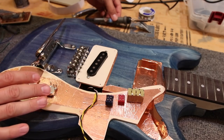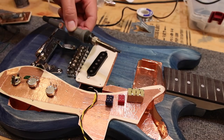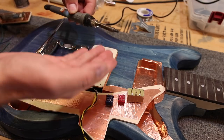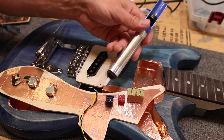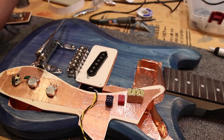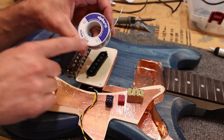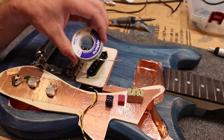I've got my soldering iron heating up here. I've shown you this in previous videos — it's just a cheap little $20 soldering iron kit. It came with a lot of cool stuff: various soldering tip attachments, a solder sucker, which you'll see me use from time to time. That's really cool — you just heat up the solder and it sucks it right out like a suction cup. It comes with solder that's actually really good, but I've already gone through that. So I'm going to be using this 60/40 rosin core solder here, and I'll link it in the description.